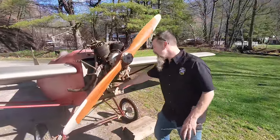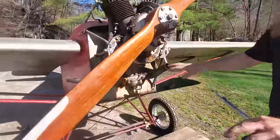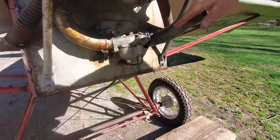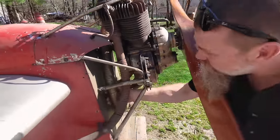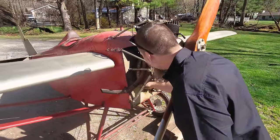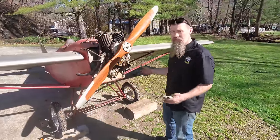It's a Schebler DLX, like a 1920s Harley-Davidson Indian carburetor. It looks fantastic, perfect nickel plating. What kind of concerns me is it's got this ultra long draw in here all the way up to the intake. It's gonna be tough. Now it's been fiberglassed or something around the outside, which hopefully is still gonna work. If not, there's gonna be crazy intake leak.